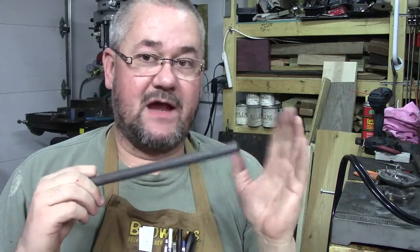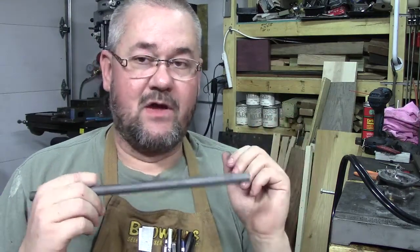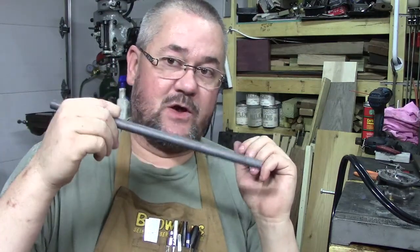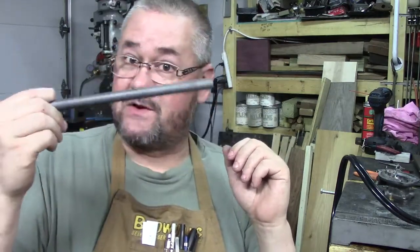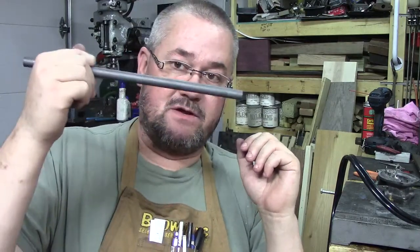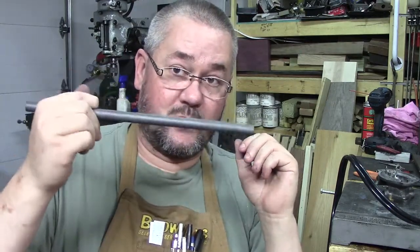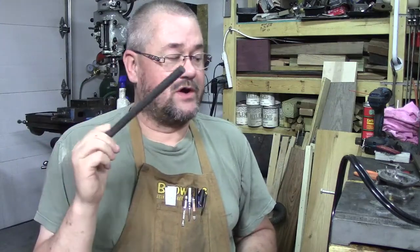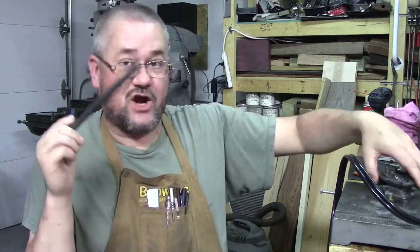Yes, I dabble in stuff like that from time to time, and those rods I use specifically for when you're melting copper, stir it with a graphite rod, or if you're stirring silver or gold or anything like that, use a graphite rod to help remove impurities. So there are other uses for them than just, we're going to turn it down and create a backer.